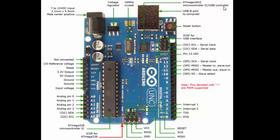The Arduino runs at 16 MHz frequency. Unlike the 8051 which has a unique frequency like 11.0592 MHz, Arduino runs on a standard 16 MHz. It has an inbuilt RC phase shift oscillator which can generate 2 to 8 MHz of frequency internally — so it can generate oscillations itself without an external crystal oscillator.